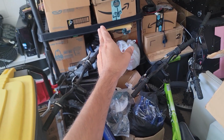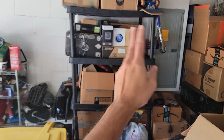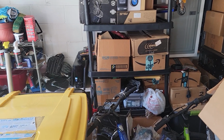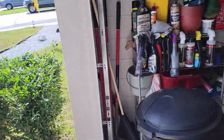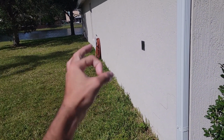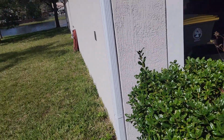Hoses going through the wall, outside to the dry cooler, and I got to run power. So 2 lines, power, 10-2, 2 PDUs somewhere on that wall or to the left of the breaker panel, and then we should be able to run power to our ASICs and do what we need to. As well, we got to be able to feed the power for the fans on top of the C2 through that same hole. So not only are the 2 hoses with the brass ends that are pretty big, but the connectors, the C13 connectors, through the wall, so that way we can connect to the PDU.